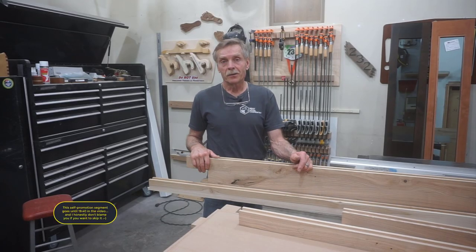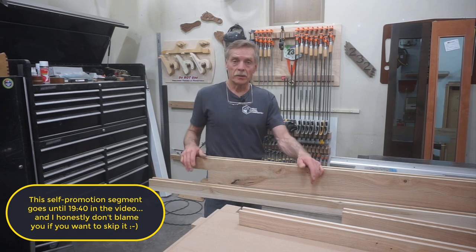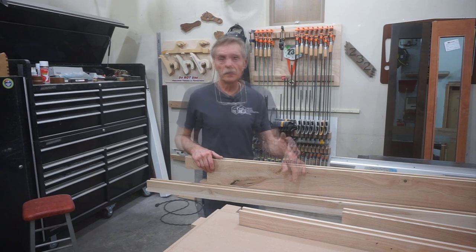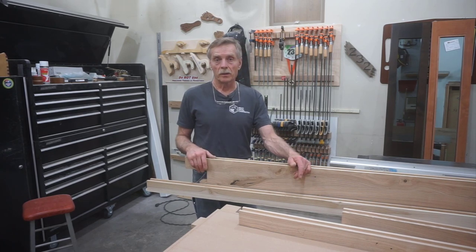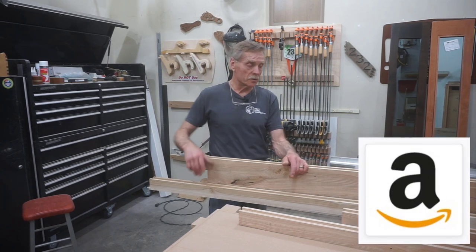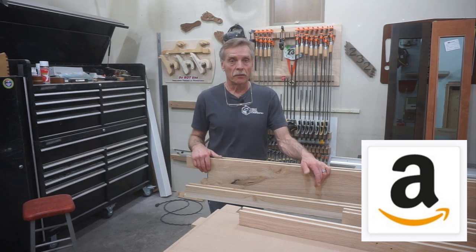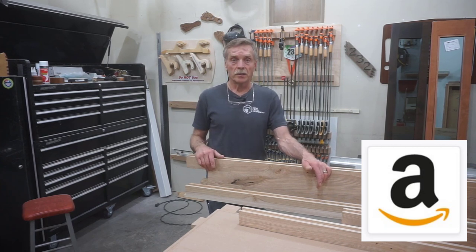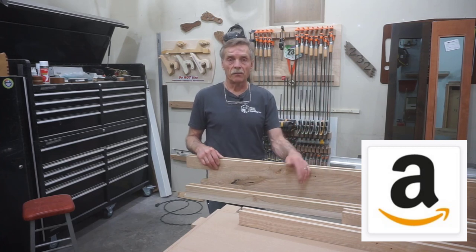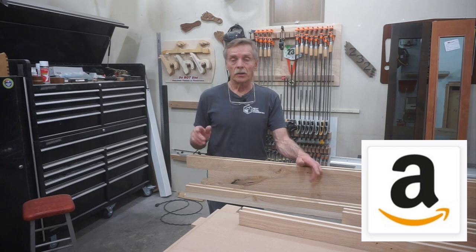The dado is comfortably snug but not too tight, and it's centered up at ever so slightly more than a half inch thick on either side. You can see the groove is centered up when I flip a short piece end for end on the long piece. This should give you a pretty good idea of what a door build looks like as I go through each of these successive steps. Even though it's an unusual door, there's a similar process for pretty much all the doors I build in the shop. If you like this kind of content — deep in the weeds instruction on more complex processes — I'd ask that you subscribe to Next Level Carpentry if you haven't already. I also remind you to check out that exclusive Starbond fifteen percent offer code in the video description, and there's a link to an Amazon Influencers page with a list of tools, materials, and supplies used in this video.